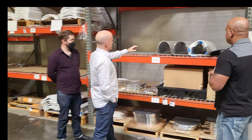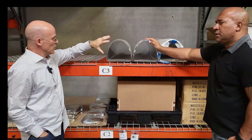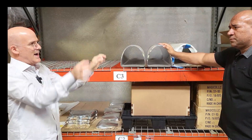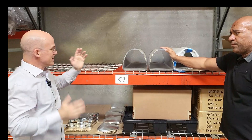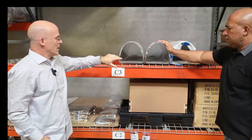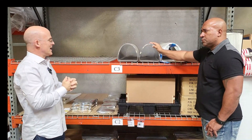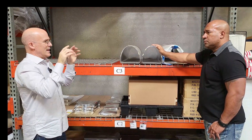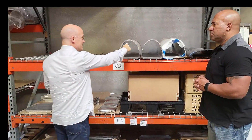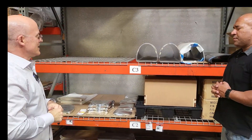This is another interesting part — this is all one extruded piece. Imagine what it takes to do that. You take a billet of aluminum, heat it up and push it against a die — think of a cookie cutter. But the center is hollow, so the center has to be held by lines in the die, and you push the aluminum through. On the other end it still has those lines, but they kind of heal and come together. So at the end you get a product with no center — it's a mind-boggling process. That's an S1, and actually the S3 is even bigger.